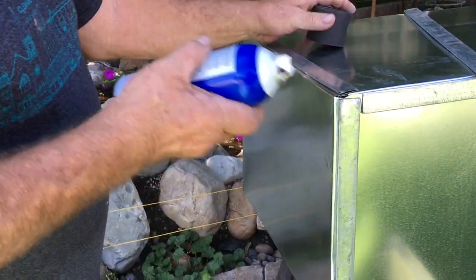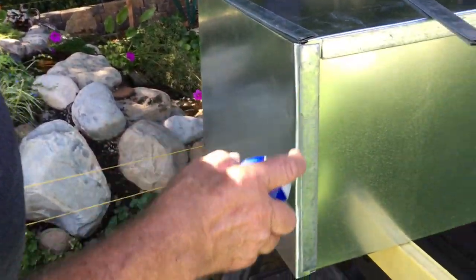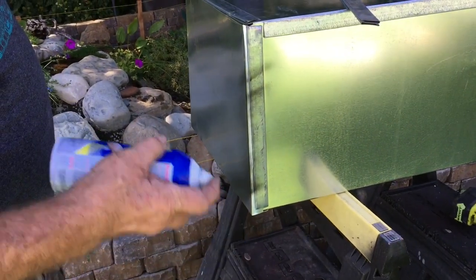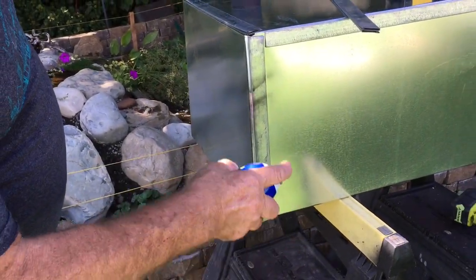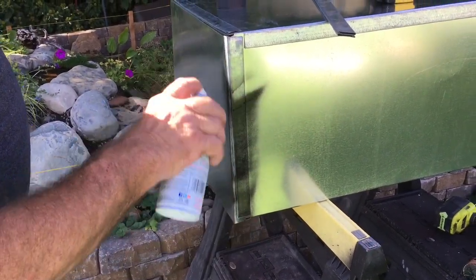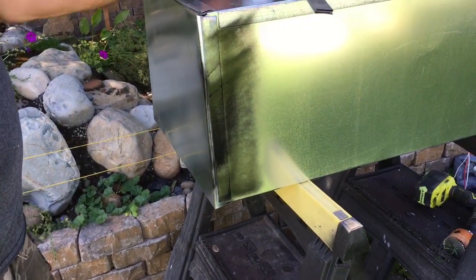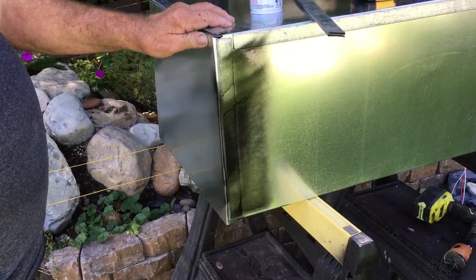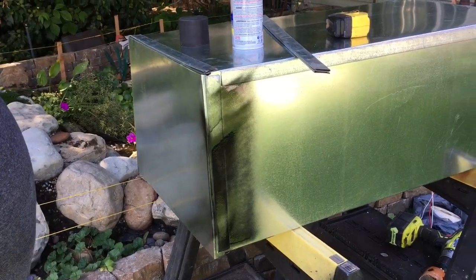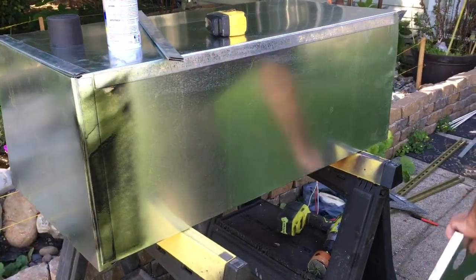And then this is kind of like the undercoat stuff. And so the whole thing, that's what they call plastic dip, isn't it? Yeah, this is the plastic dip. It's the same thing as undercoat, sort of. But we'll spray the whole thing. We'll put 2 or 3 coats of that on it, which will protect it underneath. And this is galvanized, so galvanized doesn't rust as quick as just regular steel. So that's how that ends up finished up.